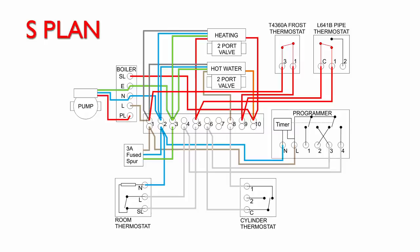That heated water is being circulated throughout the entire heating system, and eventually it will get back to the boiler, and the pipe thermostat, which is located on that return pipe to the boiler, eventually will heat up, and when it does, that will actually open and break the circuit. Now I show there that the pipe thermostat has opened. See the connections actually going onto that unused number 2 terminal, but of course not connected to anything.